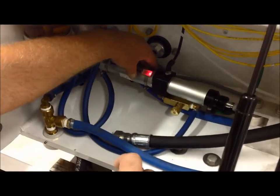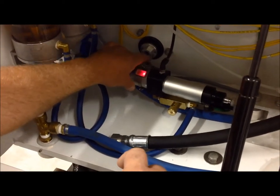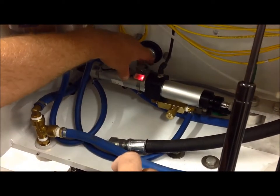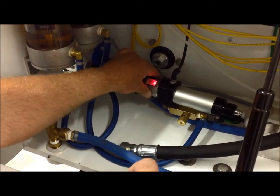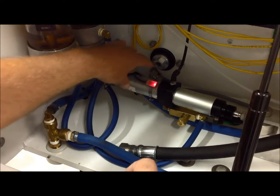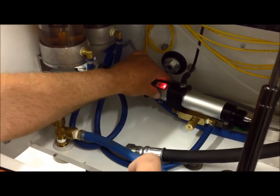Okay, here we're looking at the entrance wheel cylinder in the passenger side pod as it's installed on the Freestyler. And right now you're seeing the outbound reed switch is currently on. This means that the entrance wheel passenger side brush is all the way out and towards the wall.